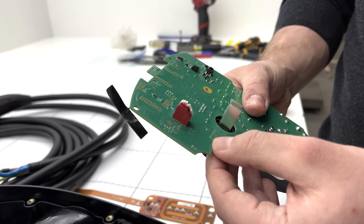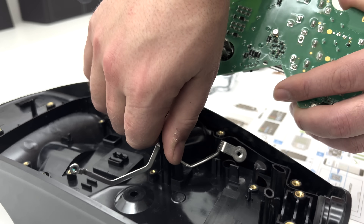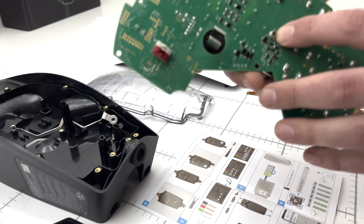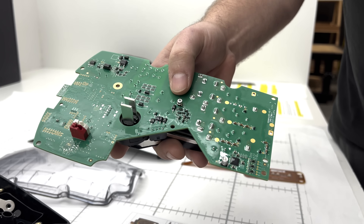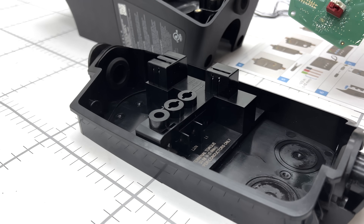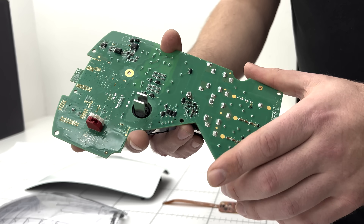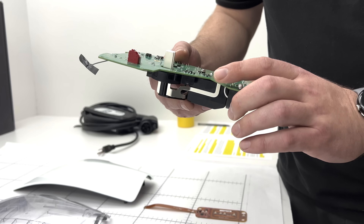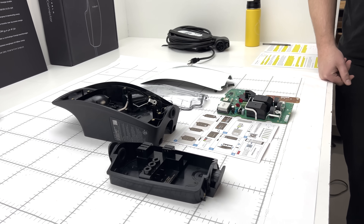There is a small sensor that goes through a hole and shines directly onto the gap between L1 and L2. This is an IR sensor or a pyroelectric — we're not sure which specifically, as there are no labels on it. What it does is measure temperature and produce an electrical current based on that temperature, allowing it to measure a heat difference between the two lines. If there's any difference — such as a short or one line drawing too much current — it will cause an internal trip as a safety feature. It's a neat little feature, very minor in size and not taking up much real estate on the board.